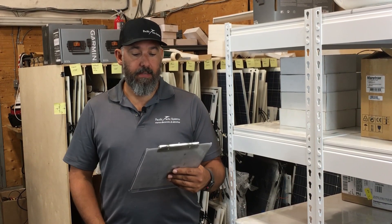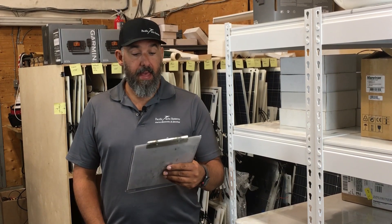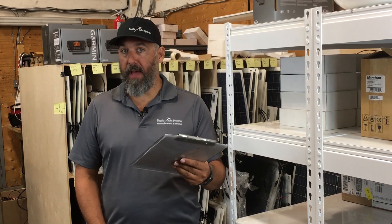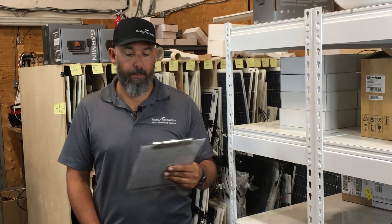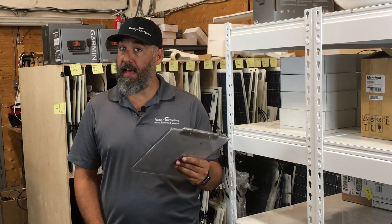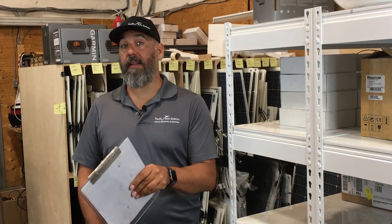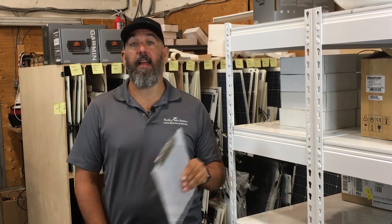This boater tells us he's got an engine that has its own starter battery. In addition, he has a house battery made of two batteries — but it doesn't matter if the house battery is two or ten, it's a house battery bank. The only source of charge for his house battery is shore power. That means his alternator on his boat is not connected directly to his house battery; it's connected to his engine battery, as you would expect on most boats.